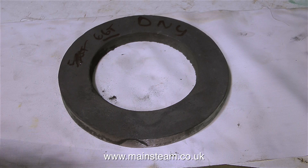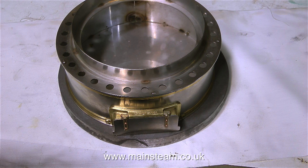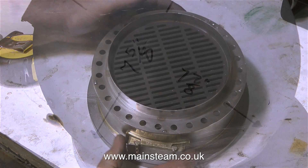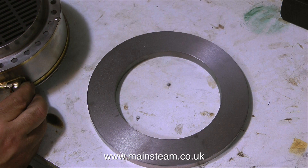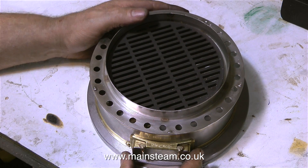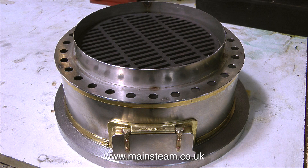This is the raw casting, and now this is the raw casting with the ash pan on top of it. I turned the outer diameter of the cast iron ring to 8 and 5/8 of an inch, and the inside to 5 and 5/8 of an inch. I wrote the dimensions of the ash pan — 7 and 5/8 by 7 and 7/8 — on the underside of the ash pan, which seemed like a good idea. The ash pan needs drilling to mount it to the mounting base, and the mounting base in turn also needs drilling to mount it to the wooden base. So here's the story so far: a really good solid cast iron mounting base with a hollow centre to prevent heat transmission through the ash pan. And that's it for part one. Thanks for watching, and I hope you found it useful.